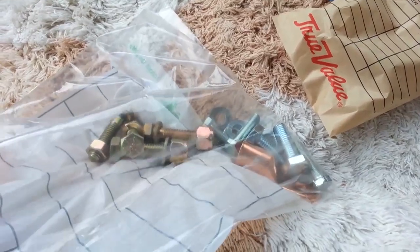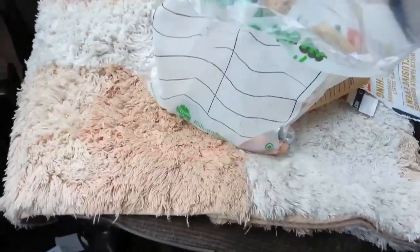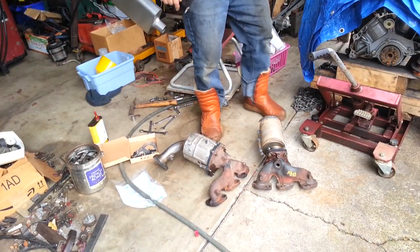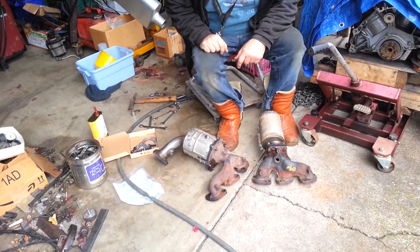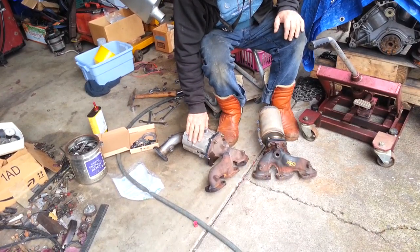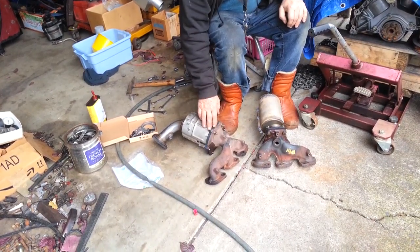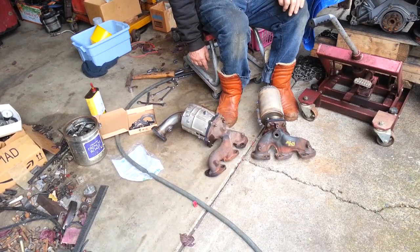This is a mock-up of the bolts to make sure that everything fits okay with the bolts I got. They're metric where they screw into the base, but where they go through, I opted to get grade 8 SAE bolts because they're stronger and much cheaper. There's a huge premium for metric bolts — about 10 times the price.